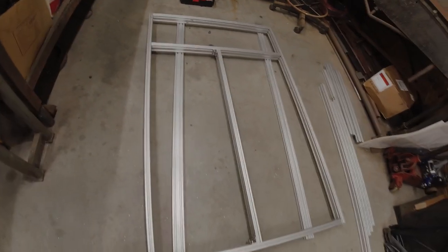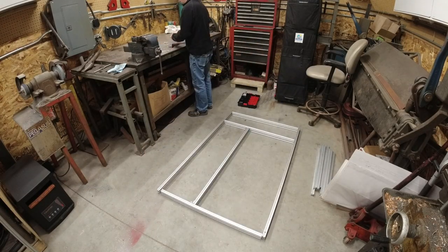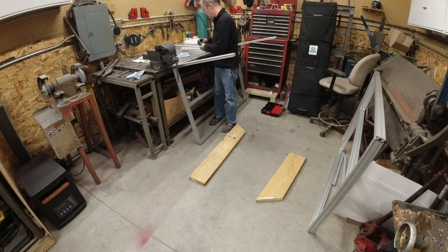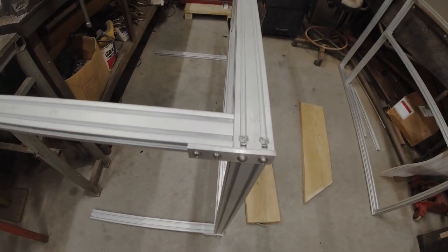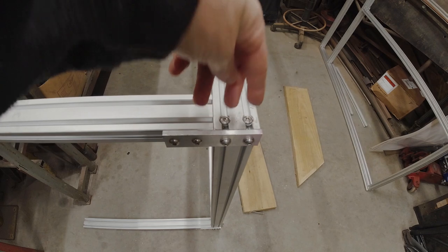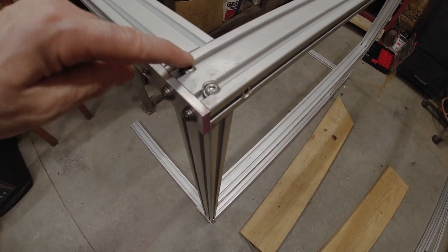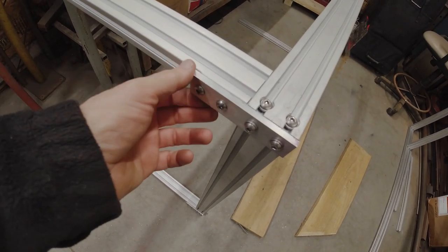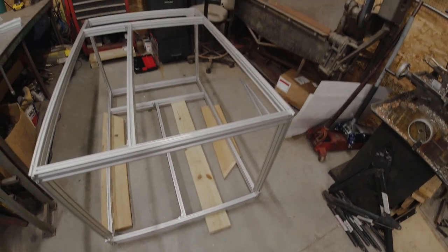Because this is going to have a bottom on it, I had to mount the carriage nuts in there before closing it up. Let's take a peek at these corners — a lot of these I tapped through and then bolted together. What that means is I cannot bolt through here to tap into here because there are bolts in the way. So what I did is I made this bracket here, just out of one-inch quarter-inch-thick aluminum, tapped into it, and used nut-certs in there.